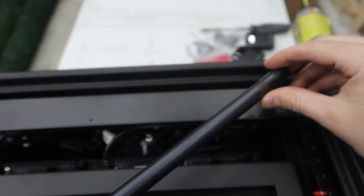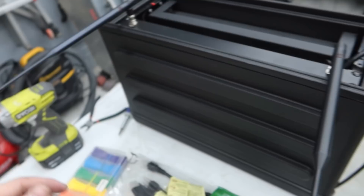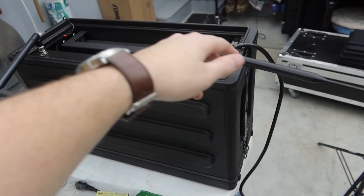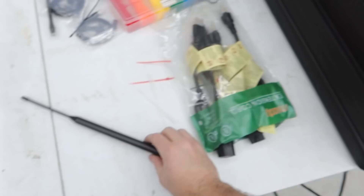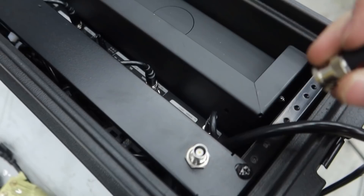Then put the mic antenna on, and what that does is allow it to have friction so it doesn't want to move easily. To show you guys the difference — without the washer this antenna flops around easily and doesn't hold its position. With the washer, when I'm whacking this, it stops like instantly. So there's a little pro tip for you guys: if you ever get these half-wave antennas, put the little rubber washer down in there and that'll keep your mic antenna sticking up nice and good. Always take it off and check to make sure it's going down in perfectly and not getting kinked.